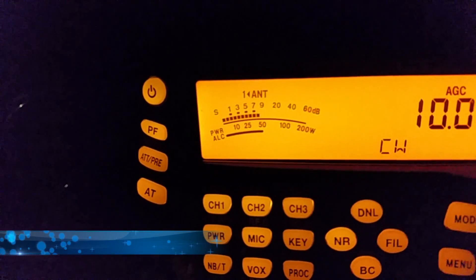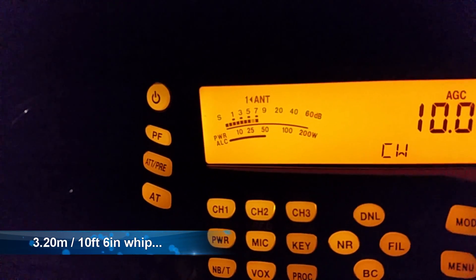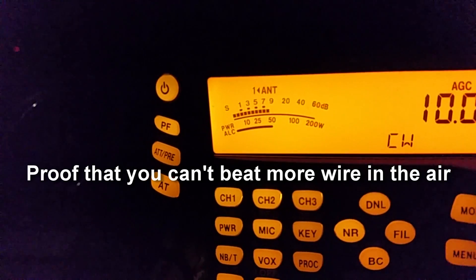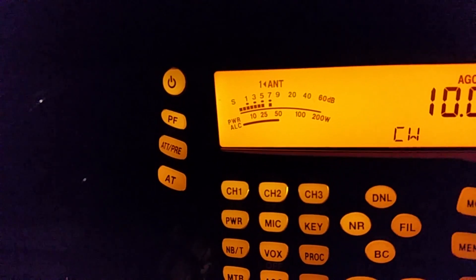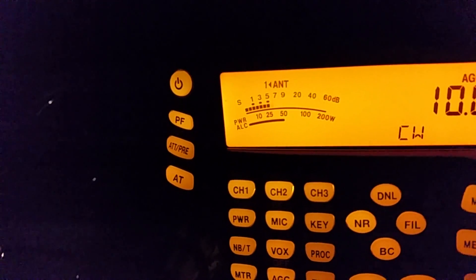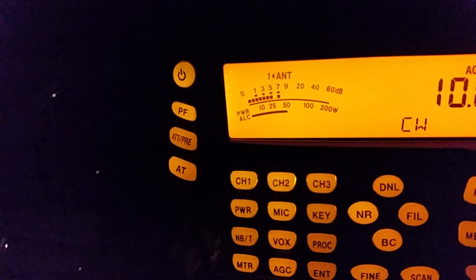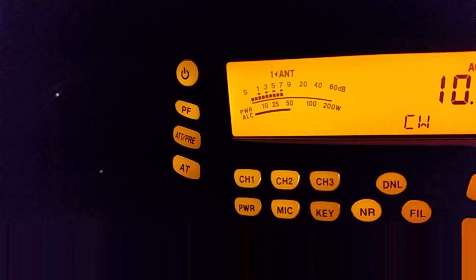And this is the 10-foot long one, which is an S8, sometimes going up to S9. I don't think this is really indicative of its performance because it's quite thin and it flops about — it basically can't hold itself upright, it's sort of leaning over to about 45 degrees. But it's interesting that when you look at how much of the coil is exposed with the stock whip compared to the six-foot four-inch one, there's less than half of the exposed coil with a longer whip, so it's obviously working a bit better.